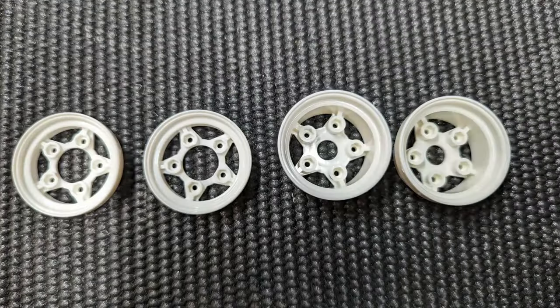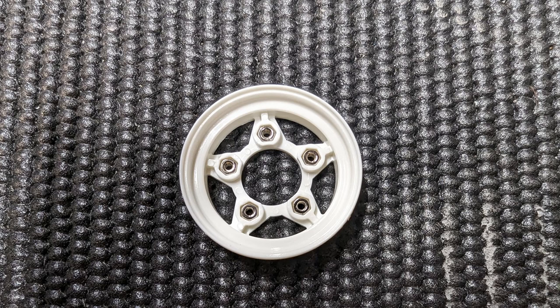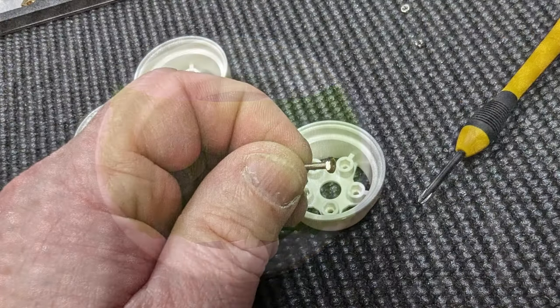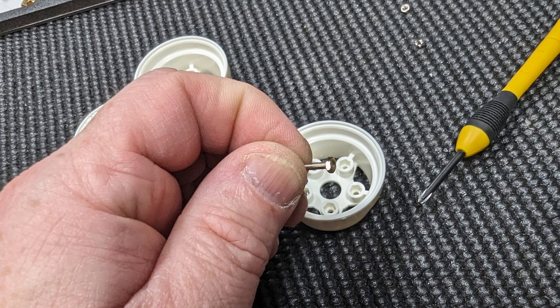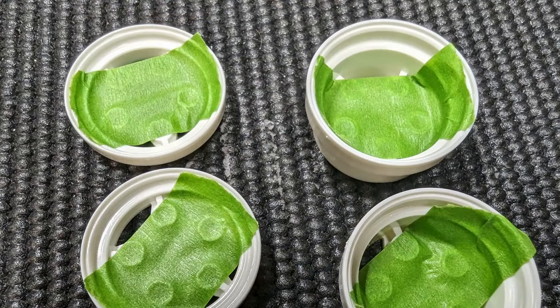Okay, so now what we need to do is get these wheels and tires put together. So get everything laid out, get your insides and outsides together, and we're going to start putting the nuts on the back side of the wheel. Put a piece of green tape or whatever tape you have just to cover up those nuts to keep them from falling out. If you're having any stubborn ones, screw the nut onto one of the bolts, insert it down into the well, and then back the bolt out. After you get all of them taped up, you're ready to start putting the inserts in the wheels.